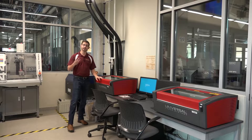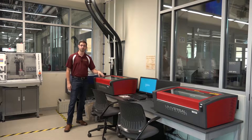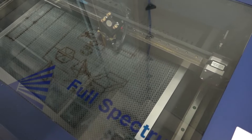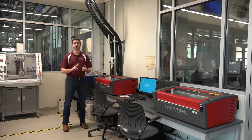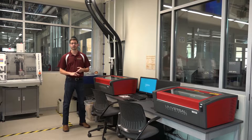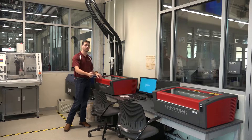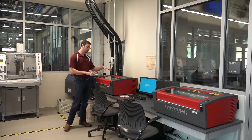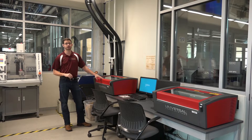In the RPM, we actually have three laser cutting systems. Two of them are VLS 350s, which are 50-watt project-oriented lasers, as well as a 190-watt Pro Series, which is a bit more industrial. Both of these machines actually suffer from the same three hazards: flames, fumes, and retina damage. When I'm talking about retina damage, I'm talking about the fact that the laser can actually rebound off the material you're cutting and burn the back of your eye. Both of these machines do have polarized lenses and covers, but this does not mean you should actually look at the cutting process.